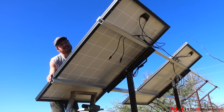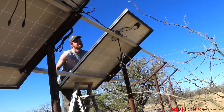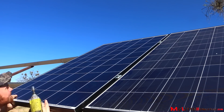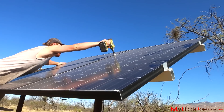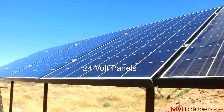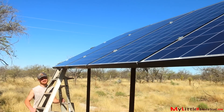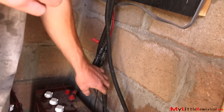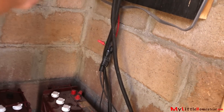It's a one-to-one ratio from panels to batteries. Garen attaches them using specific connectors for the panels. We need a little thicker wire to handle the power coming in from six panels, so I'm going to replace this wire and put a little bit heavier gauge stuff in.